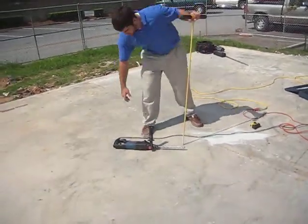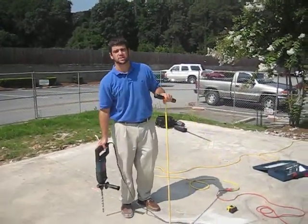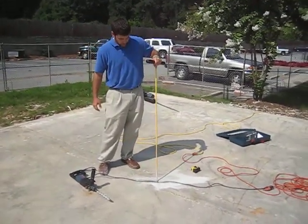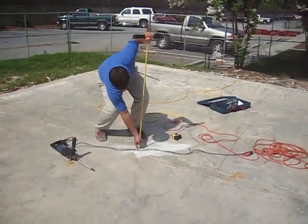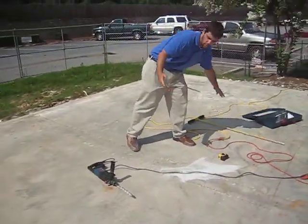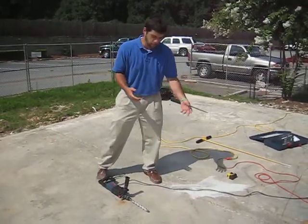We're using a hammer drill at some of these old wall locations to try to identify what the thickened slab locations were. Here we've pre-drilled a hole, right now at about 2 inches of depth. We're going to try to identify if it's a 4-inch slab, which is what we've located elsewhere, or if it's possibly a thickened slab at a load-bearing wall location.